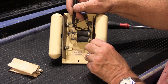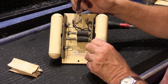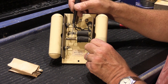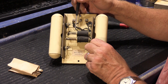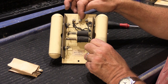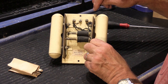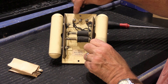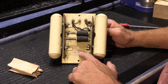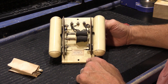We have our plungers here, which still slide. Kind of funky sounding, but for as old as it is and the shape that it's in, it's not bad. Our springs are intact and they don't look stretched or mangled, which is kind of nice. The coils are wrapped with friction tape, as you would expect. And here are our three wire connections. Underneath the dirt right here, stamped into the chassis, we have labels for transformer, front, and rear button connections. And down here we have a label: Newtone Chimes Incorporated, Cincinnati, Ohio, and there's a number 1229 — probably the number of the sticker itself, as they seemed to do that a lot in those days.